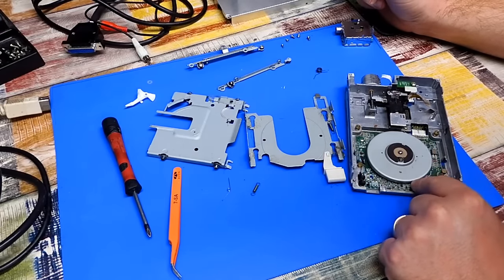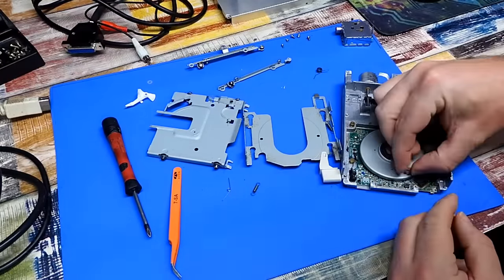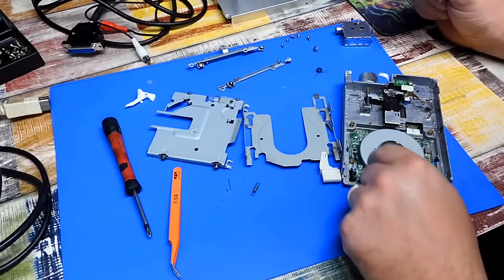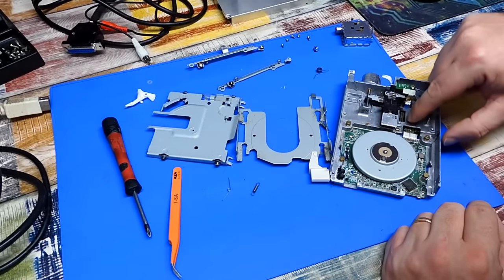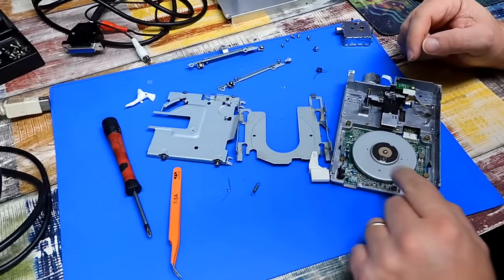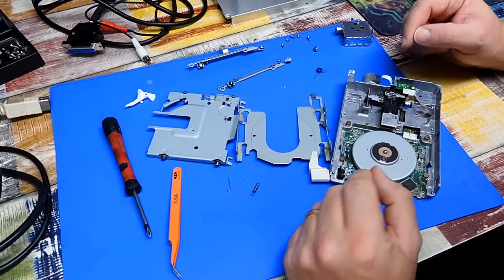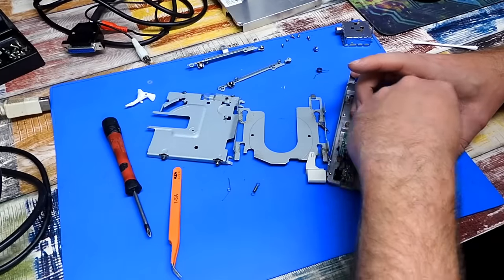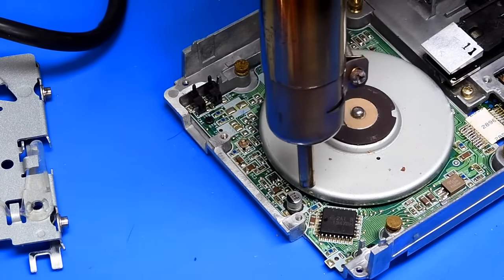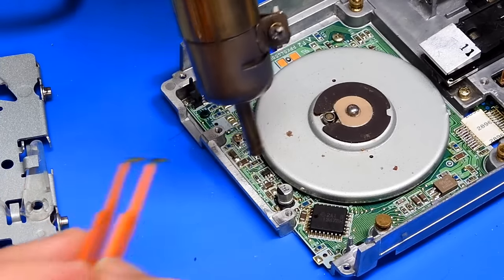There is one more capacitor there to change, another 10, 35 volt this time. There's a replacement for it there. To get that bottom PCB out, I would have to desolder that small ribbon that runs between the two. So I think we'll just try and change that in situ. But first of all, let me give it a clean. Filthy. Let's get this old cap off then. I think it's going to pop on me before it comes off.